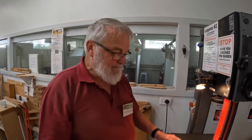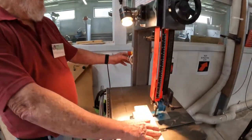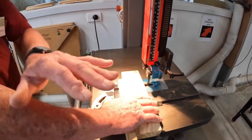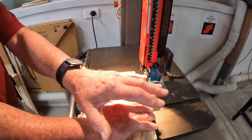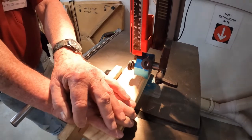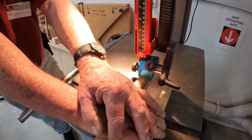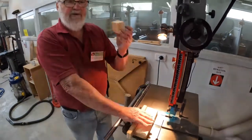We're now ready to make a cut. We'll start with a straight cross cut. Turn the saw on. Hold the wood clamped to the mitre gauge with your hand, your other hand well clear of anywhere where it could get damaged. I find it most convenient to put it on top of my guide hand. Run the timber through the blade. Stop the saw once the cut is complete — it's then safe to move that back and to remove the offcut.